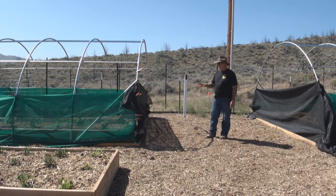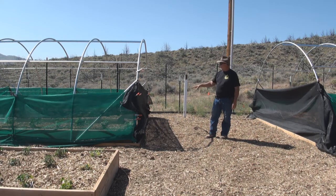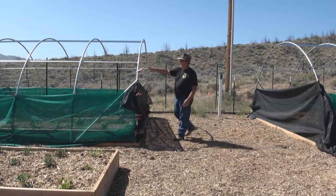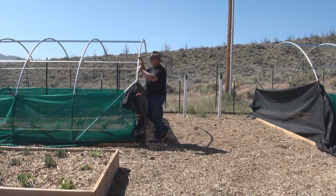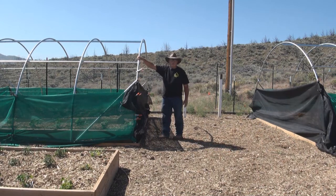We planted out a lot of stuff and I'll show you what we have. Basically, I got the shell built, the frame was up, concrete work's done, all the braces are in. I went with triple purlins up here, which gives us much more support. I went with hoops on four foot instead of six foot for more strength, and our winds up here — I think that's going to be important.